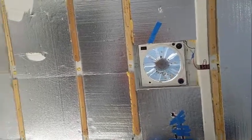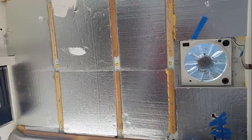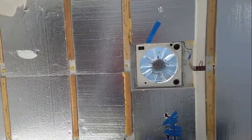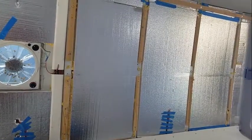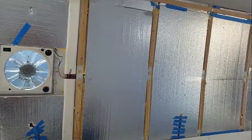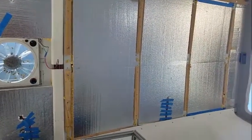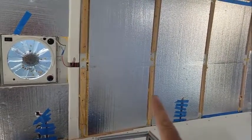This video covers installing the ceiling. We have cross members with wood attached, which is even with the insulation so it's flat across. There's an exhaust intake fan here. Taking a page from Humble Roads' book, instead of installing one large ceiling panel, I'm going to do sections — one here, one here, one here — that can be installed and removed individually, held in place with an aluminum strip that runs across.